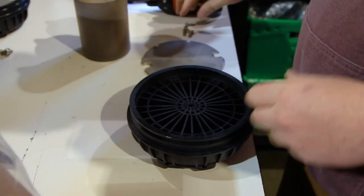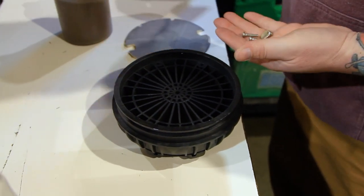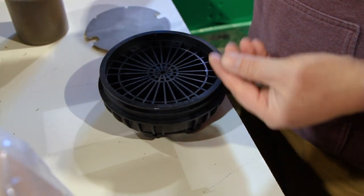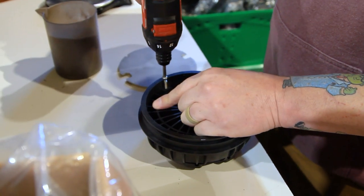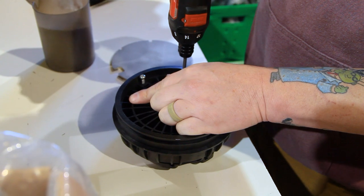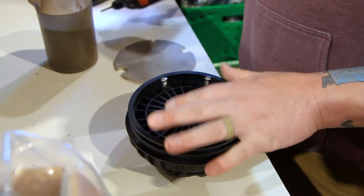Next, we'll install the steel shot and weight plates. This step is for our Blacktip Tech and Exploration models only, as the Travel does not require additional weighting. Fasten the four M5x18 screws partially into their holes on the bottom of the nose. This will make sure we don't spill any steel shot into these spots later.